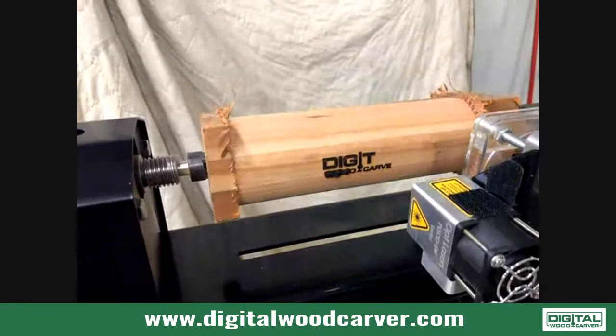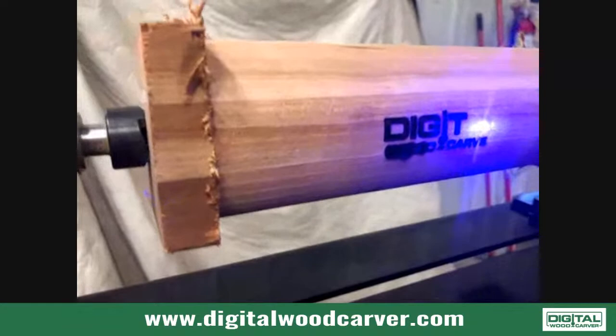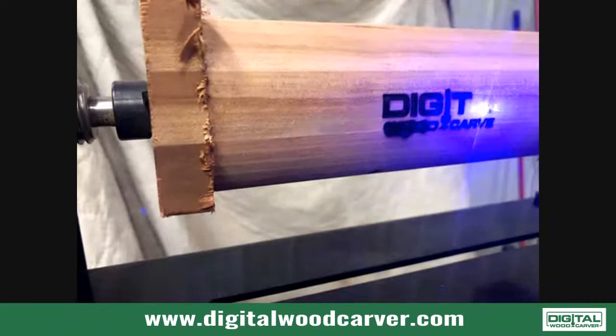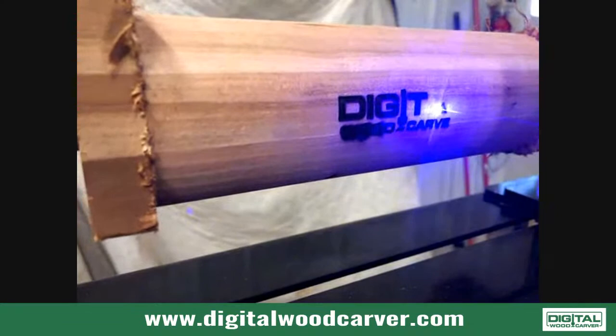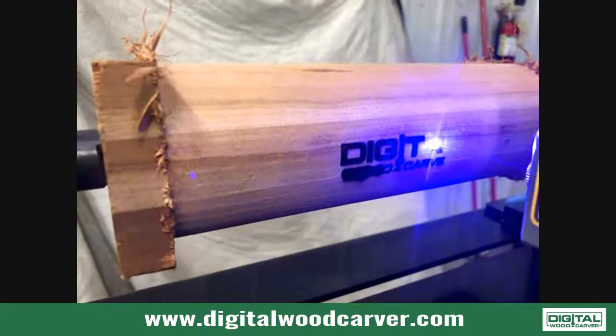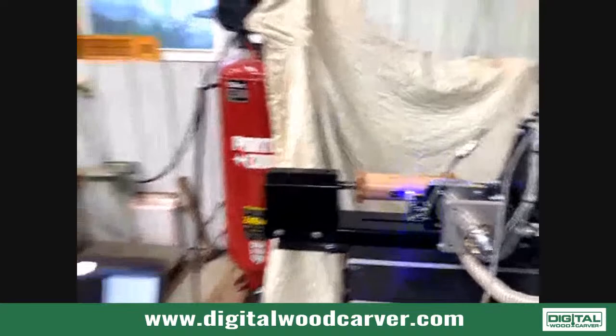And now you can see. All right, I want you to look at the first part of the wood carver. You can see where my settings, which I did to him last week, were extremely high, running 80% power on that, and you can see that burning. When Burl made the adjustment in the software and tuned in that carving, look at the D and then the word carve and the rest of that digital, how nicely detailed that is. So adjustment, tuning in and getting tuned into your feed rates and your power settings with your carving and with laser engraving is very important. Practice, practice, practice makes perfect. And for me, never carving on a fourth axis, I set it to the settings that I would run if I was on the table on something. But Burl was able to quickly adjust that, and it's looking really good, Burl.